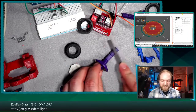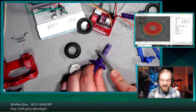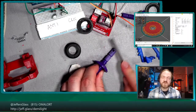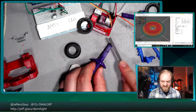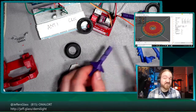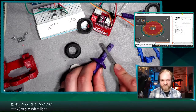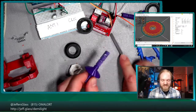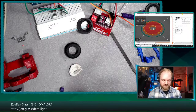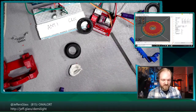Also, all of the mechanics are electrically interlocked in relay logic, right? So the controller actually isn't doing any of that. Things like you can't put the main landing gear down if the main landing gear door is closed, because there's a pair of physical limit switches that only allow that wheel to move down if that door is fully open, things like that. So there's nothing that I could do in my controller that would actually cause mechanical things to run into each other, which is very comforting for a software developer, novice like myself.